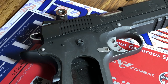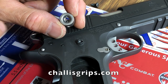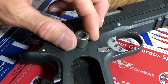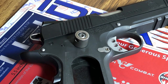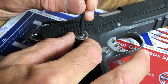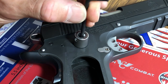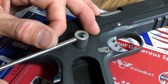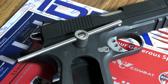Here's the little extractor that has teeth which engage the slots in the bushing. First, set it on top and rotate it so the teeth fit into the slots in the bushing. Then you use the original bushing screw and screw it in — this firmly attaches the bushing to the extractor. Then you have a little torque bar that you slide in, which allows you to apply a lot of torque to the entire body of the bushing without putting excessive pressure just on the screw slots on the head.